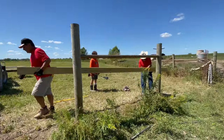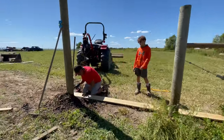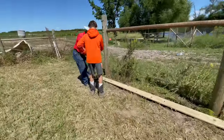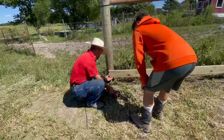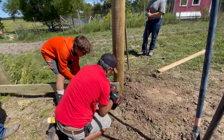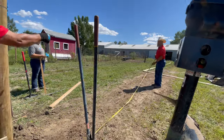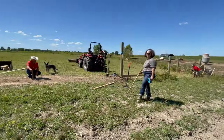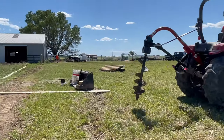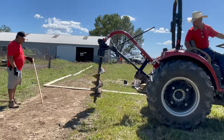We're just setting the ends of this board — a five-quarter board, a typical deck board. It's one inch thick, six inches off the ground. We're going to consider those our high and low points, the beginning and end of that board. We're aiming for an average of about six to eight inches maximum. Why that low? We have pigs. Most cattle people, horse people, start at a foot — a five-board fence to get to six feet. We need six boards.